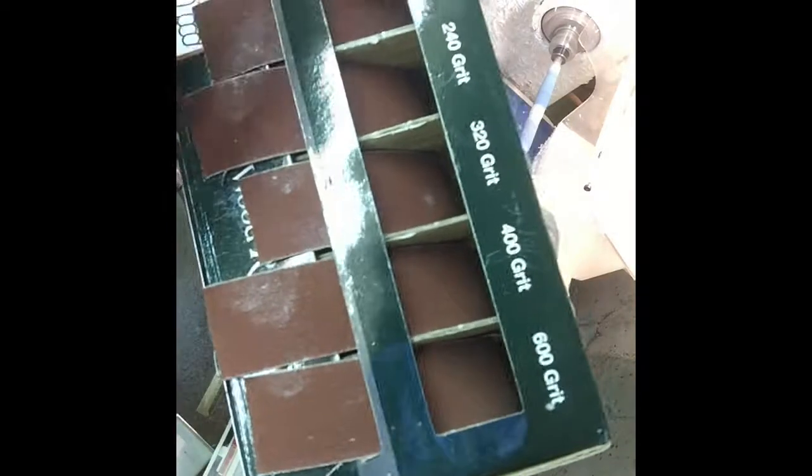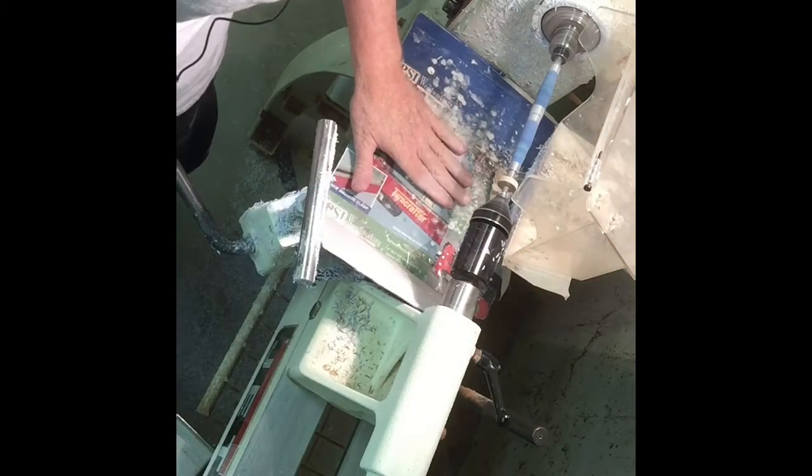I just recognized I didn't have my microphone so I'm reshooting this. Went through all the grits — you can buy the 150 grit in separate rolls and reinsert it because you'll run out of that one first. You'll always have the others left over. Use smaller and smaller pieces as you go because you don't need to sand as much — you just want to get the scratches out from the previous grit. I put a coat on right as I finish.